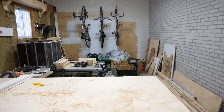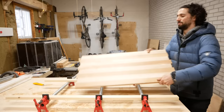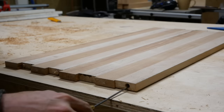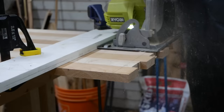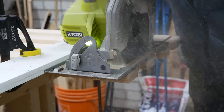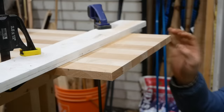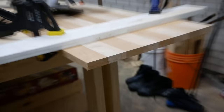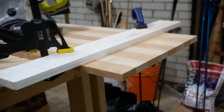It's been about three days at this point. At this point I want to trim the ends at 90 degrees, but all of these pieces were dowel-jointed together, so I need to make sure my cut is inset far enough to go past the dowels — looks like about an inch past the end. There's still a tiny bit of dowel showing; we didn't go quite far enough. There's another one there too, so I'll scoot the fence over a quarter inch and take another slice.